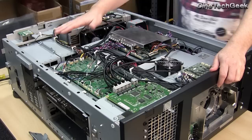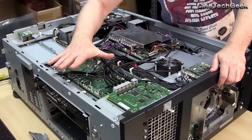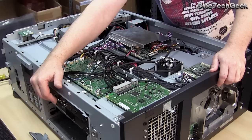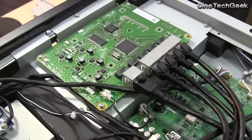So here we are inside the projector. As before, we have basically the brains that control the projector from NEC and then the media block, which was pretty much completely redesigned by most manufacturers when they went to the Series 2 projectors. Apart from the ICP, which I think has some design from TI, compared to the Series 1 — which was mainly TI — they all have their own sort of implementation, but they're all very similar because they're based on what TI has given them.